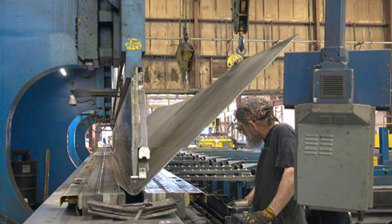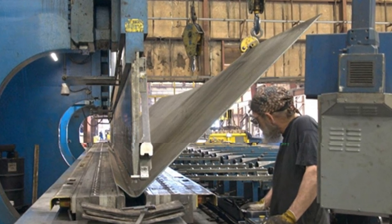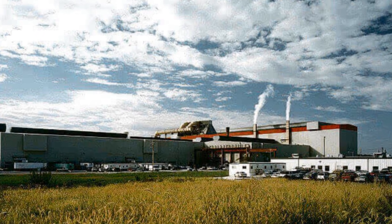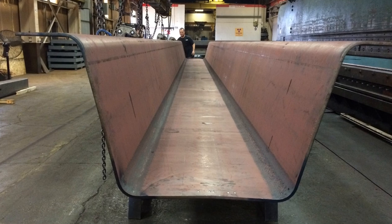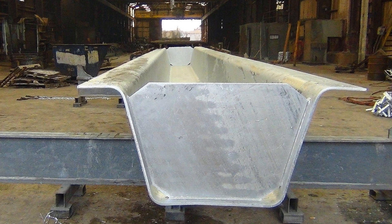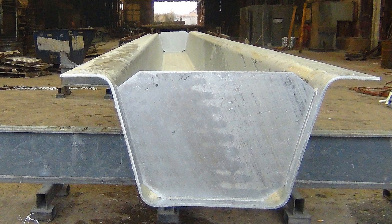The system is what we would call our standard U-beam press brake form tub girder, which consists of AASHTO M270 grade 50 steel — the standard by AASHTO, also known as A709 grade 50. It's made with United States steel; the steel for this project was provided by SSAB Americas, produced right near Cedar Rapids, Iowa. Once the steel plate is provided, we form it into that classic press brake tub girder trapezoidal box shape. We weld angle braces to the top flanges, then weld end diaphragms at each end, which also serve as bearing stiffeners for the elastomeric bearing pads.